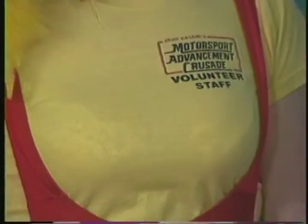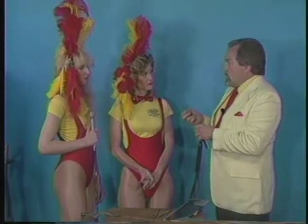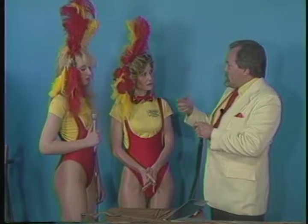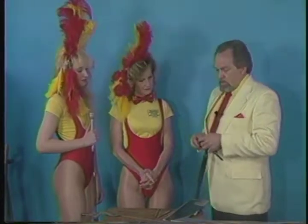Anyway, this is one of those things that you grind into a point on a grinder. And by the way, boy, does it chew up grinding wheels. This stuff is really hard, all right? And the pure tungsten, which I'll show you in a few minutes, you don't grind into a point. In fact, it forms a little ball on the end of it all the time, and that's for aluminum welding, and that has to do with the fact you're using alternating current instead of direct current and a number of other things. Again, we don't want to try to make you experts. I just want you to understand a little bit about what goes on here.